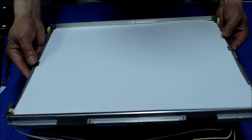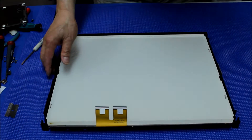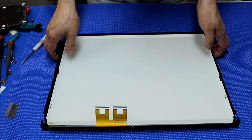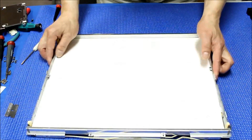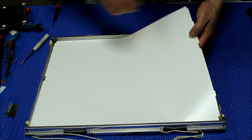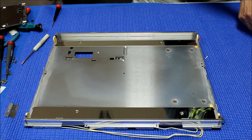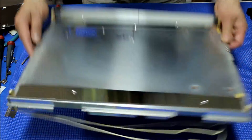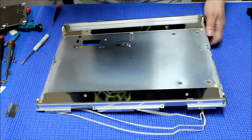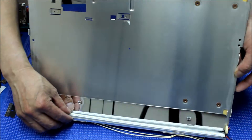Now this is the big glass assembly. So we're going to carefully set aside this liquid crystal glass here. And then, you can actually take this one out — just put it on top of a plexiglass sheet to make sure it stays clean. Basically, you can unscrew it and take it out, and we're going to mount our LED kit. Because there are six lamps, it can actually fit in pretty well. So next thing, we're going to remove the metal cover and mount it back.